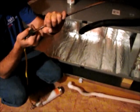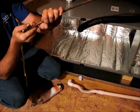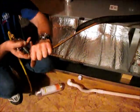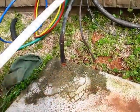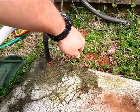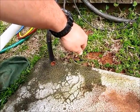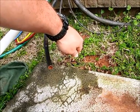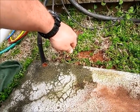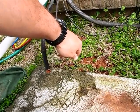I'm going to show you the other end of what it actually looks like once the flush is activated in the system and starts blowing out all the contaminants. Now we're on our third treatment of the liquid line. The technician's going to fill the flush up, make sure the line is good and filled with the RX11, and we'll have two nice and clean line sets ready for install.